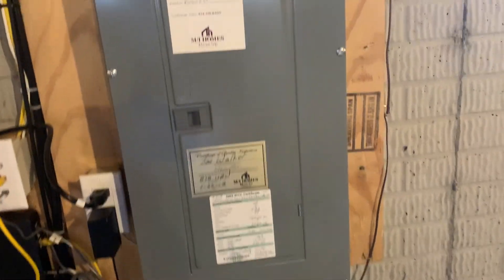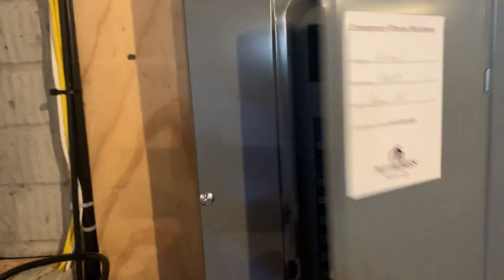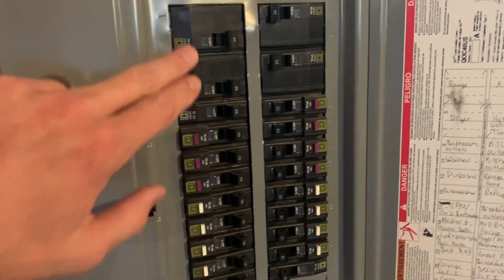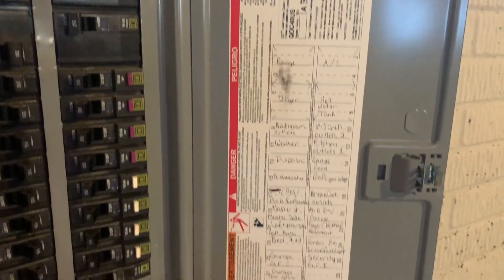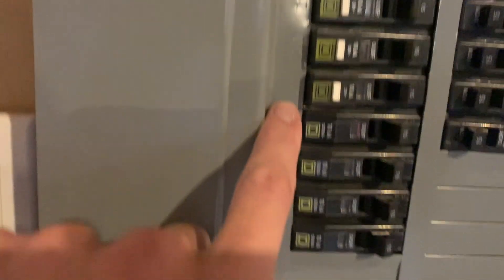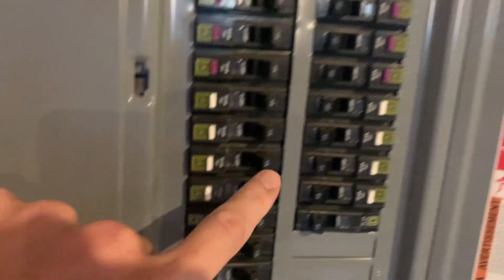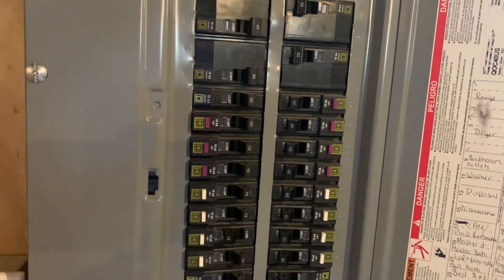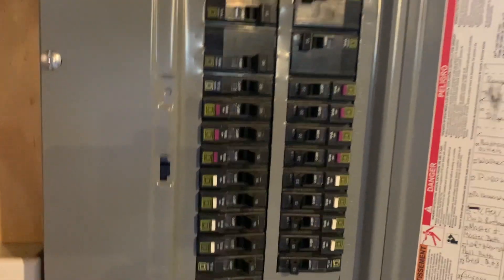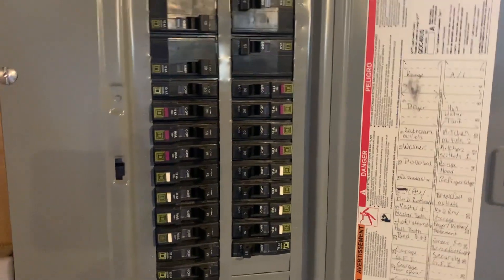So this is my fuse panel. As you can kind of see here, it is a standard fuse panel with the house. Everything is labeled and detailed as far as the outlets and fuse sizes. I'm going to be going into my loft area. When I look at it, I can see that the loft is number 21. So I'll find number 21 — that is 21 right there — and I'll turn the fuse off. It is off. When I go upstairs I'm going to check it just to be sure. For illustration purposes I'm showing you it's off, then fuses back on, because it makes it kind of dark up there. Once we're done we'll turn it back on and we'll be good to go.